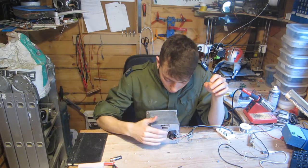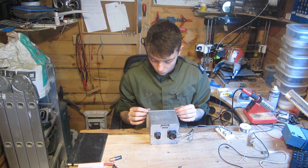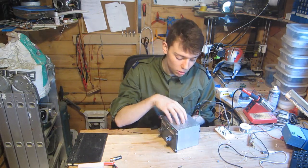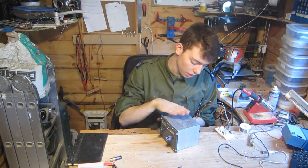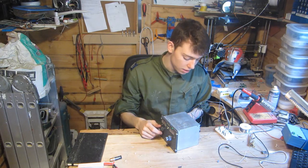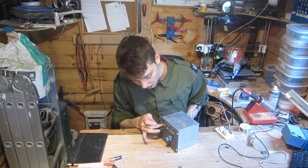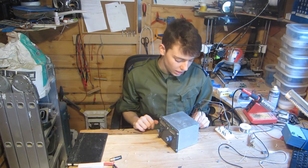So now the next challenge is to figure out how to get an output from this box to which channel is selected. So I'm assuming that this is going to be multiplexed by somewhere. We saw all the diodes and things, because there's obviously more channels than pins on the backside. So we need some way of deciding which channel's which, and also which channel is the active. So that is the next challenge.